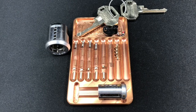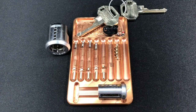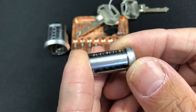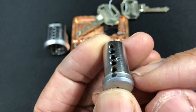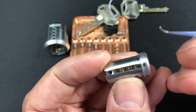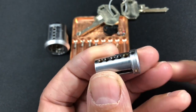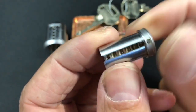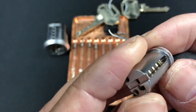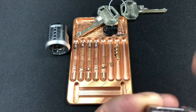We're going to start with the actual components of this fantastic lock, reassemble it, get it picked, and go from there. Starting with the core — as you can see we've got serrated chambers right the way through, and plenty of drill protection. With a safe deposit lock you'd expect that, so we've got one midway through, one right at the front, and one to protect the sidebar, and the same on the other side. A very, very good lock. I believe it's hardened as well, so you definitely won't be drilling this one out in a hurry. The sidebar sits here, the two springs are located there, and the sliders are all spring-loaded too.